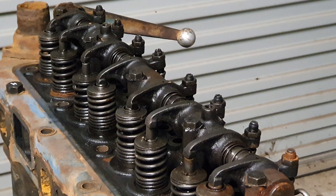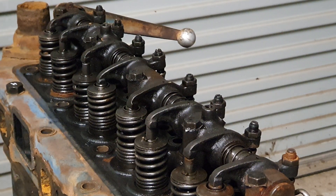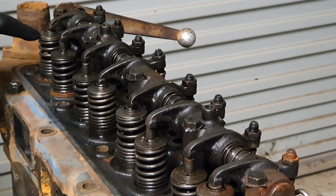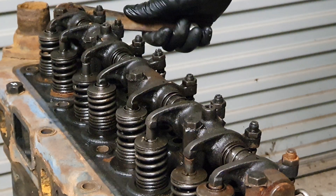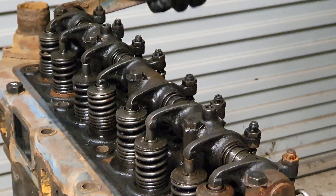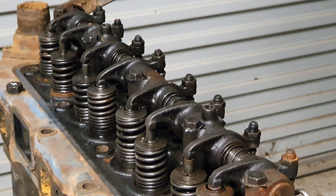So you will see that as I lift the decompression handle, you'll notice that I'll ever so slightly push some of these valves down so they're not seated anymore. So let's have a go. Pay close attention — very, very slight movement.